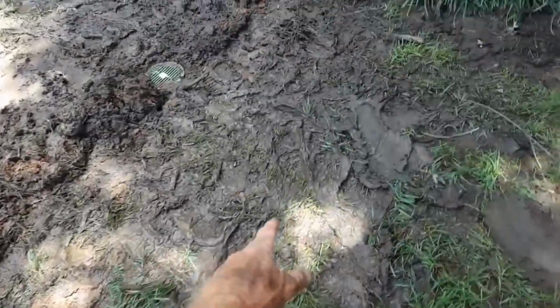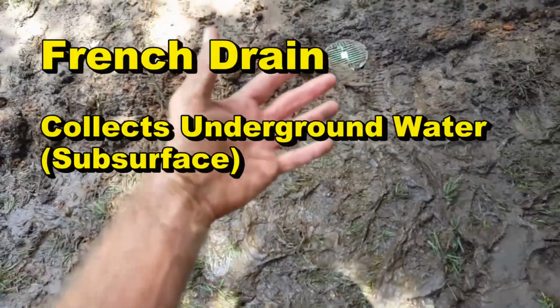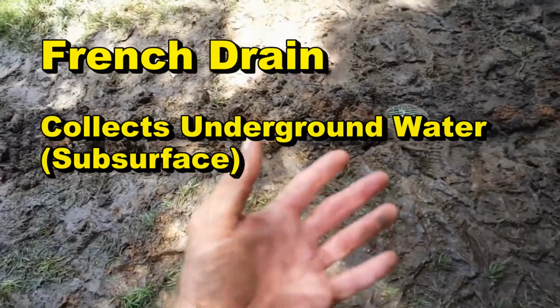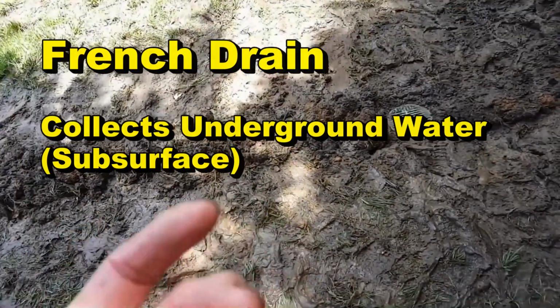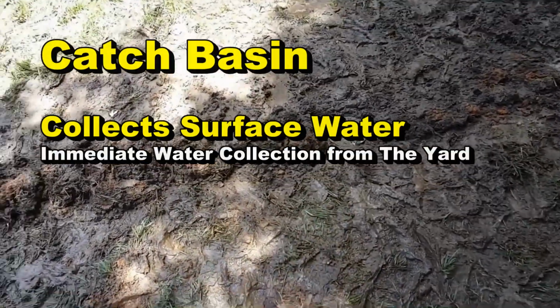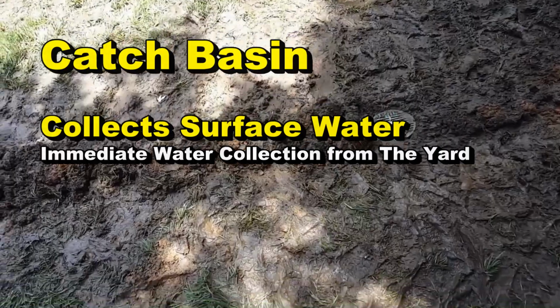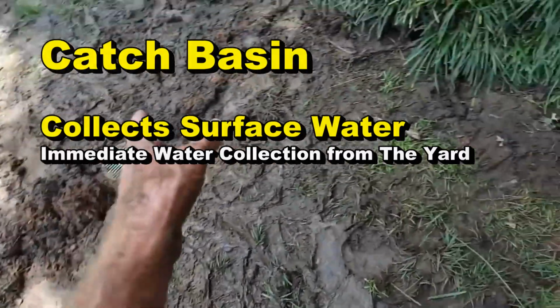And this is really soft and wet, but it just has to dry. It'll get soaked up into the underground system, which is the gravel perforated pipe. People call it French drain. That collects subsurface water. And catch basins, they collect immediate surface water runoff. So when it rains, water can pour directly into your system.